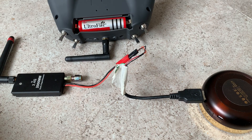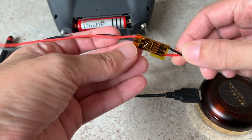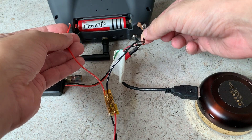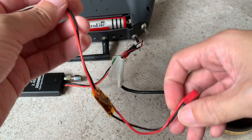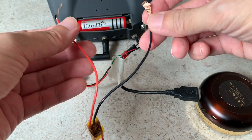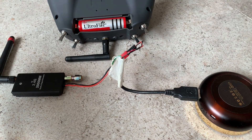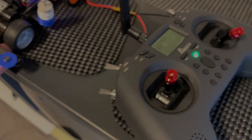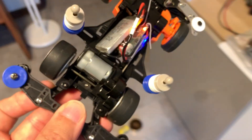Since it's not practical to use a 5-volt power bank, we're going to use this step-up regulator which will increase the voltage from the one-cell 18650 and step it up to 5 volts to power the amplifier. Let me hook up everything and test that the whole setup doesn't overload the power supply — that battery over there — and then we will do a range test as well. The receiver is bound, with the orange light indicating so.